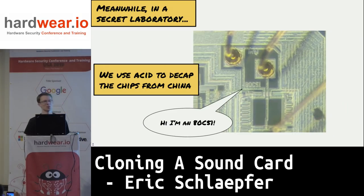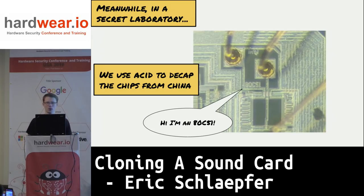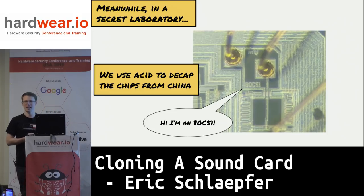Now we're getting back to the original problem of this 8051 microcontroller. We're at a secret laboratory — actually John McMaster's house — and we use acid to remove the lid off the chip and confirm that yes, it is an Intel 80C51. That's great because it means we can look at the ROM and figure out the bits. Unfortunately, it's an implant ROM, which means you cannot visually tell the difference between a 1 or a 0 using optical inspection.